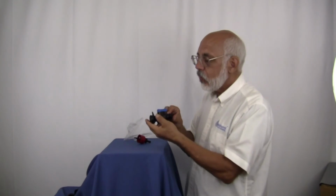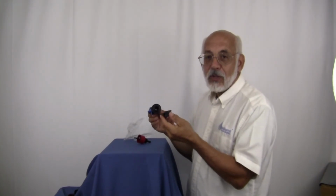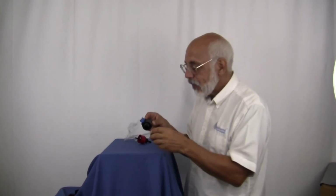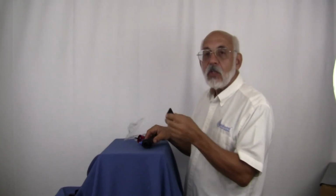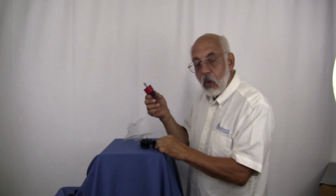And again, as you screw it in, you want to be able to hold your thumb onto the thumb tab so it keeps the gasket from spinning around. Especially if you use a little bit of soapy water, it's going to want to spin. So you'll hold it down with that. What happens to get you that watertight seal with the gasket is as you screw the quarter turn ball valve into place, it helps to expand the rubber gasket into place. And that's what's going to give you your watertight seal between the gasket and the sidewall of the gasket going back into your container.